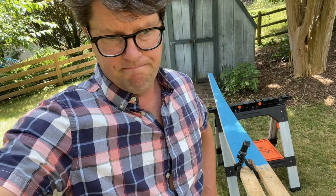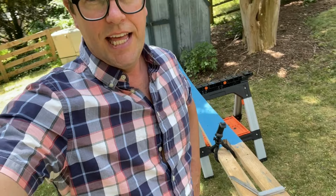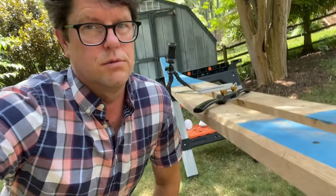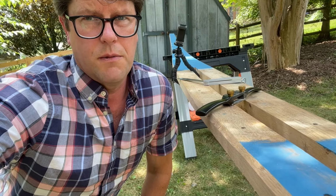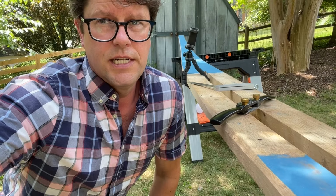It's finally just about time to carve the rabbet into the keel. I've been avoiding this, putting this off, facing it with some trepidation. But I've faired the frames just about as well as I can do. And I got a spoke shave, which was my first, and it's actually working like a charm on this. So sharp and so smooth. We'll go from station to station with the markings that we made with the bevel gauge, and soon, hopefully, we'll have a rabbet cut.